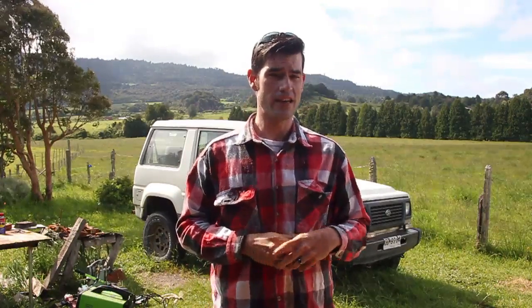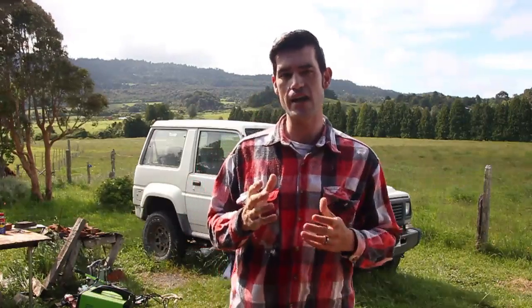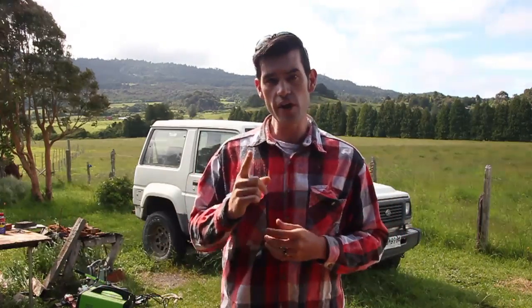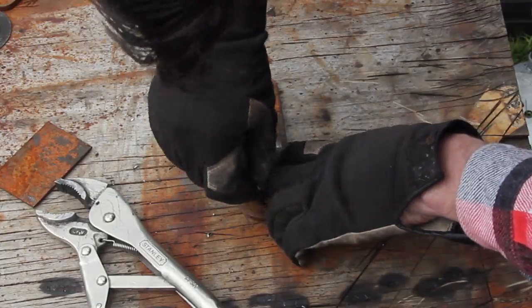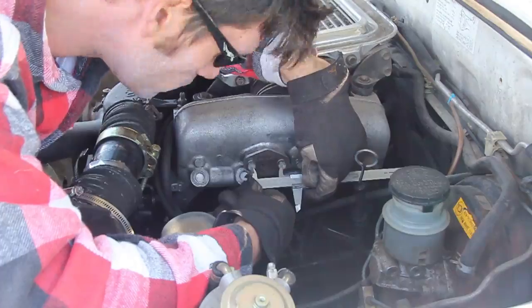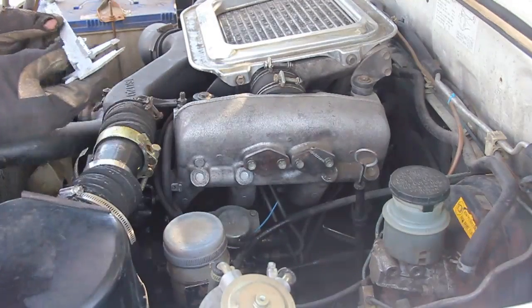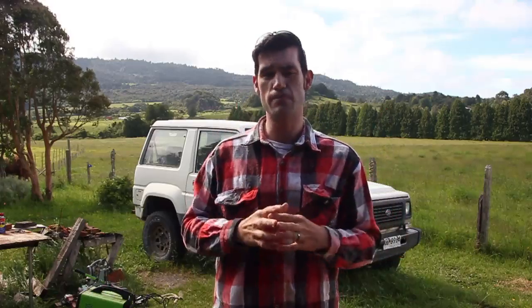The fact is that with the EGR valve block-off plates, or any kind of manifold block-off plate on an engine that you might need to make for your vehicle, there are basically three ways to make it. One is that you use some removable portion that has a mating flange, and you trace that out on a piece of steel, and then you cut it out. Two is that you take measurements of the narrowest ends and the tallest end, because most of the time on engines the manifold flanges aren't square. They are sometimes, but typically they're kind of like an oval or a triangular shape. So you could make precise measurements of all these different things, and of course always take the center to center of the bolt hole measurement so you know where to put your holes.